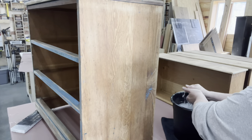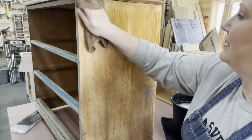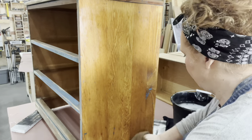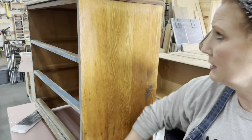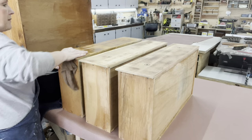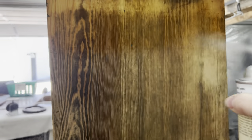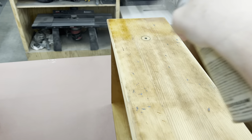I can't believe he got as much paint removed as he did without using a chemical stripper. You just have to determine what mess you want to make — a sanding mess or a stripper gummy mess. Now I'm cleaning it off with that same mixture of Super Clean and hot water. There were some deep grooves where some of the paint was still in there, but that's okay — it's character and I'm going to be covering it up with paint. The original might have been stained — you can see some natural wood underneath — and the wood is really dry, so I'm going to seal this in with some shellac also.